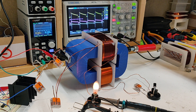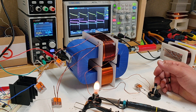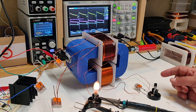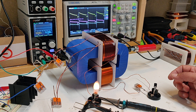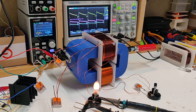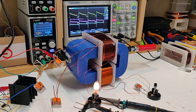I think it was at a different duty cycle — about 10 percent duty cycle. Anyway, my point is: keeping the polarity of the diodes the same, using different frequencies and duty cycles, you can find the correct effect or the opposite effect. The correct effect is input goes down, light bulb gets brighter, and output on POC1 gets bigger. The wrong effect would be the bulb dims and the output goes up — or the bulb dims even if the input is going down a little. It is frequency dependent and duty cycle dependent.